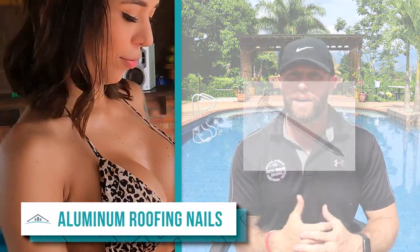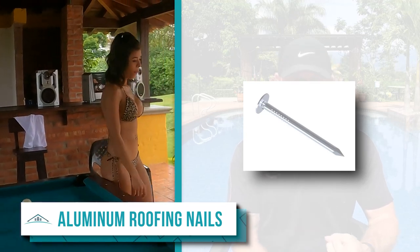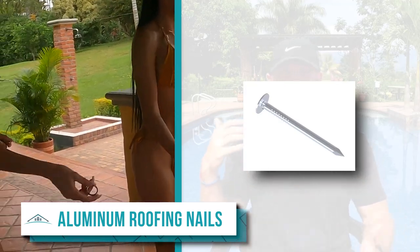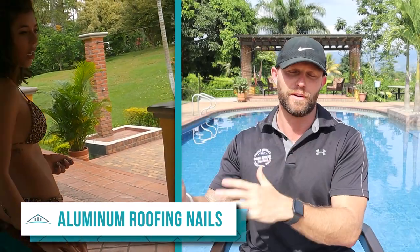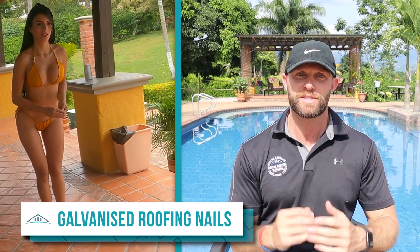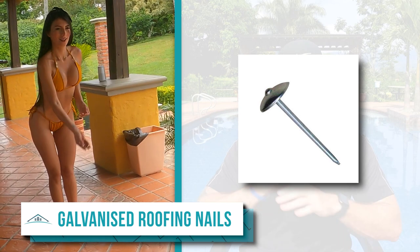All right, next is aluminum roofing nails. The benefit of aluminum is that it will not chemically react with a cedar shake, shingle, or any type of wood shingles. Wood roofs and aluminum roofs are probably the only time that you're going to use an aluminum roofing nail. Any other application, you're just not going to use it. Now, probably the most common that you've heard is galvanized roofing nails. Galvanized roofing nails should be the standard choice for most everyone reading this article. It is what we recommend using for all asphalt shingle roofs.